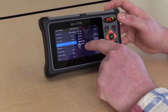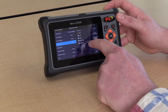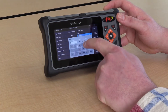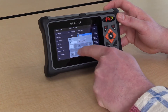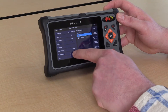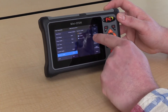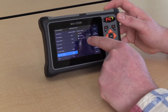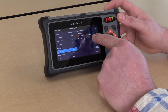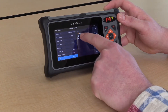Here's your test time duration: 10, 15, or 30 seconds. It has a real-time function, which is a good troubleshooting application within the OTDR, and it also allows you to customize your testing time length. You can utilize the lengths of your launch cable by programming the length in. You input the length of your launch reel and specify how many events you want referenced before your actual test cable. It also has a receive cable referencing section so you can test and certify the last connector on your test. You can also change the unit of measurements from kilometers to kilofeet or miles.